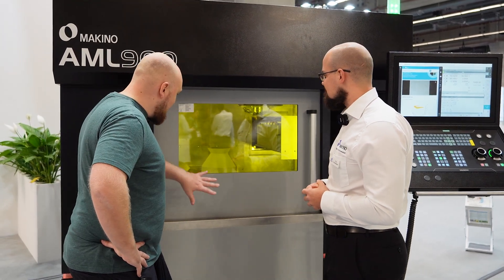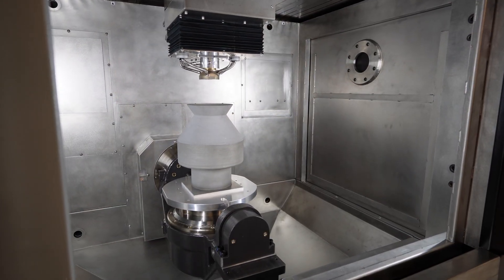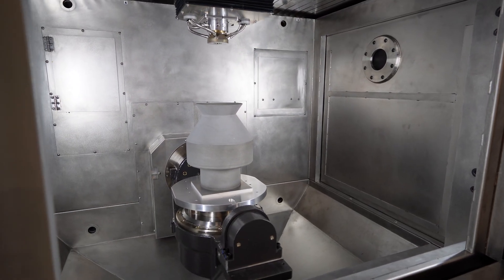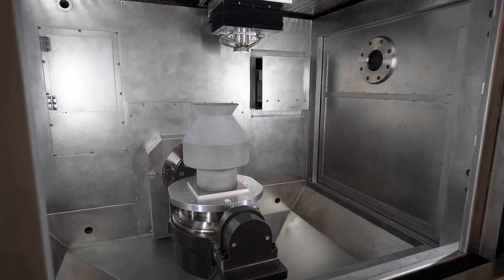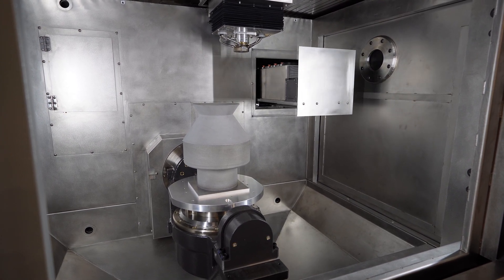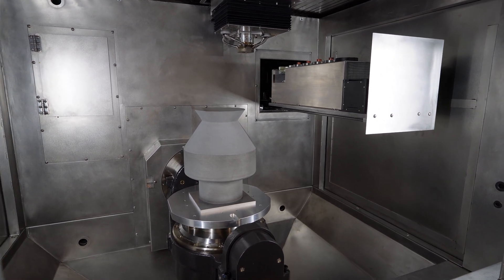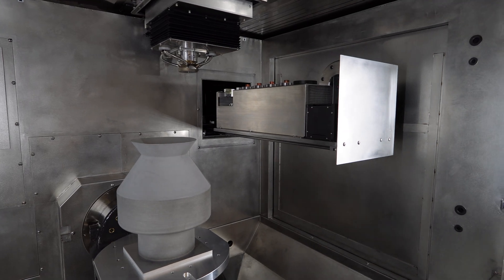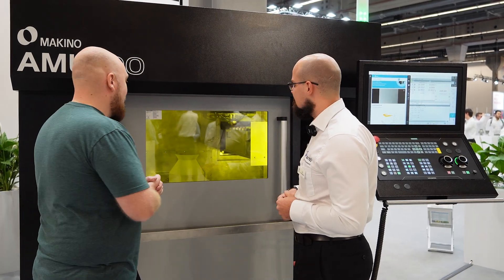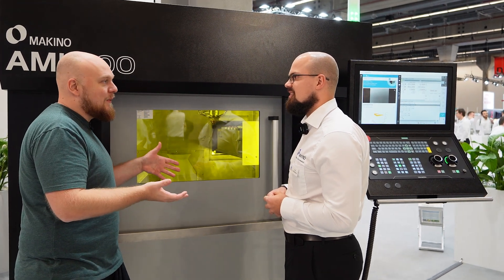I can also see there is an arm in the middle. What's the purpose of the arm? This is our rotary workhead. It has two rotary axes, B and C, and can spin and swivel around. So it's basically doing all sorts of shapes while the nozzle is doing its thing, and then you get special designs like this. It allows us to print overhangs, to print 90-degree edges and to be able to print support structure-free. So instead of using supports you're just tilting the material and you do it that way.